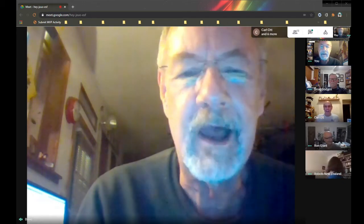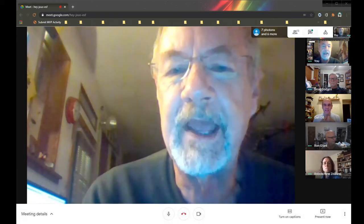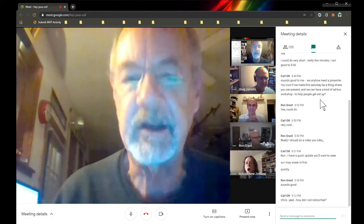Okay, well, I haven't done anything with robots in weeks. I did discover that the problem I had been chasing with the LCD display fundamentally turned out to be that I had outstripped the capabilities of the little power supply I was using as I added more and more functions. So I was chasing this thing in software for several days. I even got a new LCD display thinking there was something wrong with it, and it behaved exactly the same way. So I got a new power supply, and all my problems went away. So just a warning.